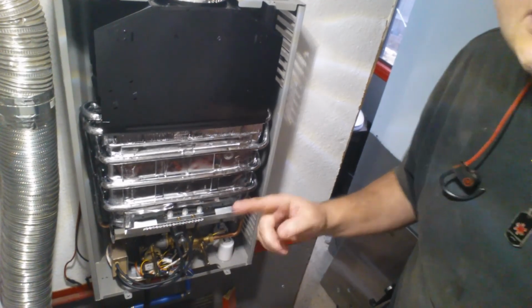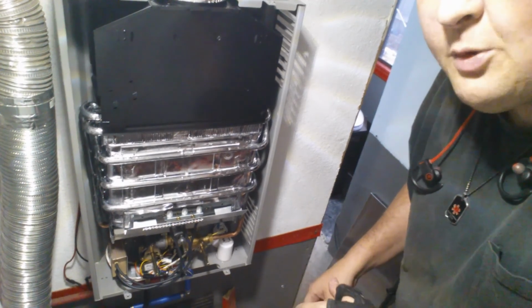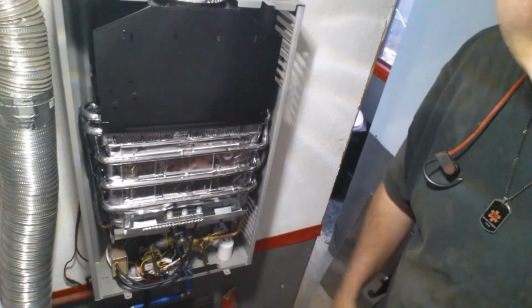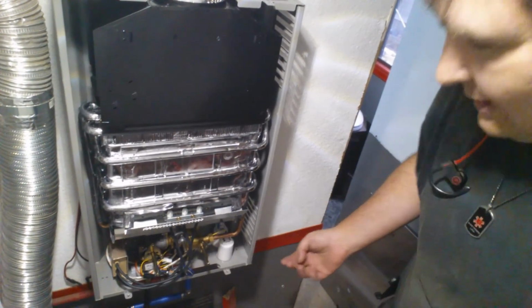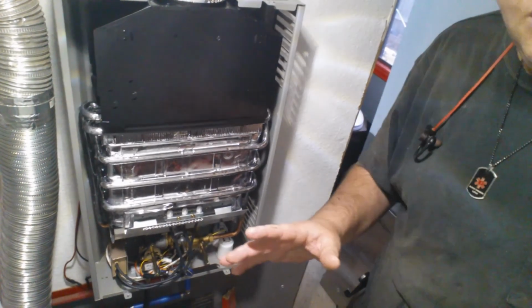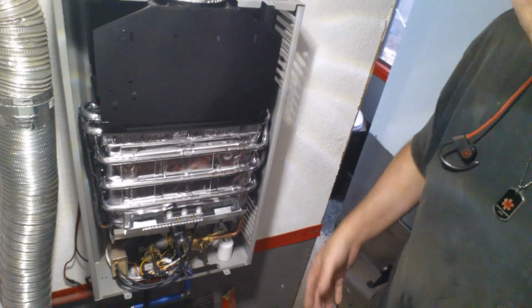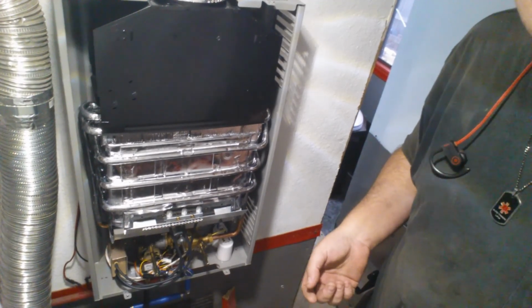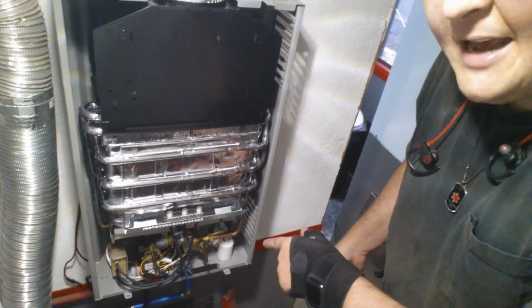I checked the batteries. The brand new batteries I just put in this one, out of the package, I checked were a 0.1 and a 0.2. So it would click, click, and that was it. So I went and got another pack of brand new D batteries, checked them. Those were reading 1.6. That's normal for the batteries. Grab them up, put them in. Click, click, nothing. So I decided, well, what the hell? Pulled the batteries back out, test them, 0.2. I grabbed up the other batteries and put them back in there. So, new batteries, tested, 1.6.